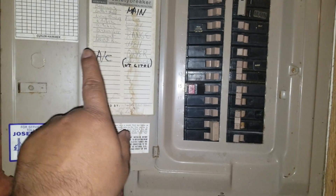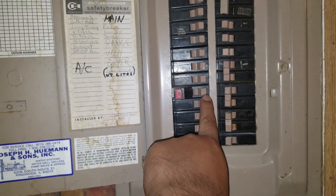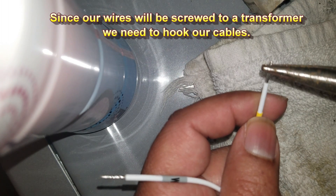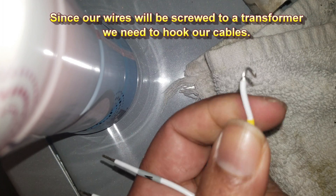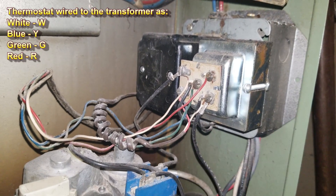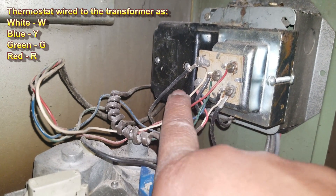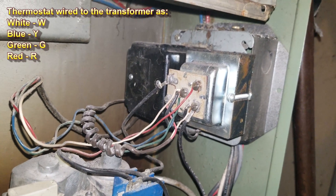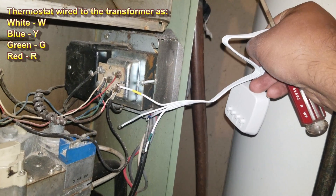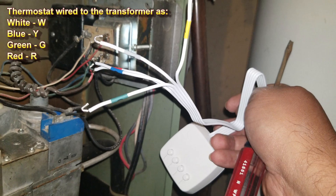All right, before you go to the next step, make sure you shut off your breaker. But before you do that, you better let your wife and friends know because they'll kill you if they're in the middle of something. So what we want to do here is go ahead and give these guys a little bit of a twist. Here's your red, here's your white, there's your green, here's your blue coming over here on the left. They've got these other ones — there's no way I could do this without my tripod. We will wire this guy in in just a second — it's going to take place of where those guys are, and these wires coming from the thermostat are going to go right into here.